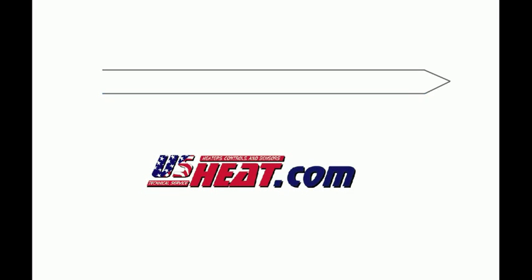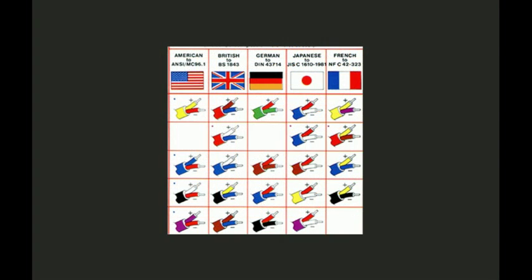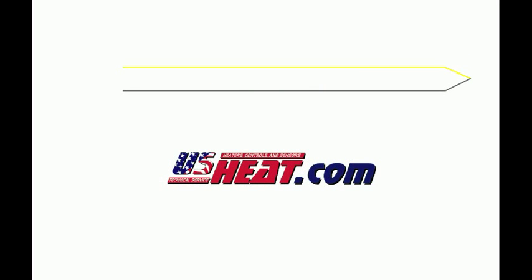How is a thermocouple made? A thermocouple consists of two different wires made from different metals, which we call legs. These two metal leg types can vary. These different metals are what determine the type or calibration of a thermocouple. These different types of thermocouples all have different colors which correspond to the different metal wires used. These calibrations all have different temperature measurement abilities and ranges.